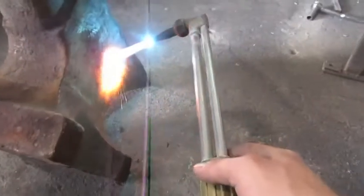So here it is when it is prepared for welding. I have drilled some holes in it to provide greater penetration, there as well, so I can make a new corner to the heel. The top is ground flat some more, and the corners are all beveled.